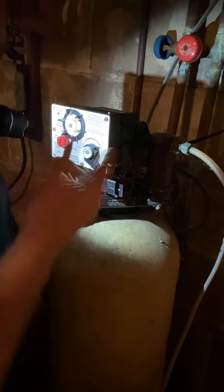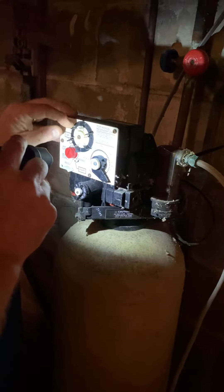The original problem was it wasn't plugged in, and the red knob was open while the blue knobs were shut — that's called bypass, because it's bypassing the softener. When you want the softener to be softening the water, the blue ones need to be open and the red one needs to be shut, like they are right now. That way the water can't go straight through; it has to come down, go through the softener, and back out to the house as soft water.